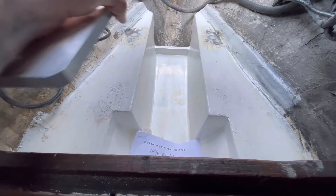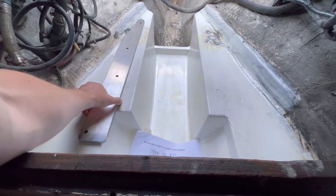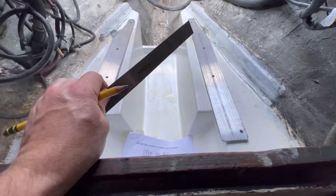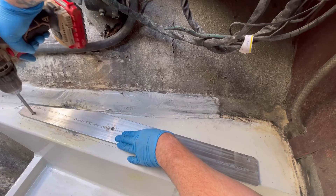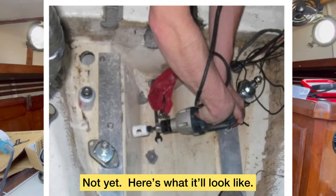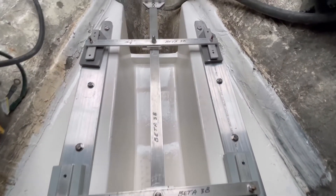These pre-cut long aluminum plates — the four engine mounts — will sit on the plates at the locations shown in our diagram for the Beta 38. Once the mounts are in the correct positions, we're going to drill 3/8-inch mounting holes for the long plates through the fiberglass engine bed. Along the side, I'm drilling one-and-a-half-inch diameter access points to feed through the washers and nylon lock nuts that will bolt these long plates down.